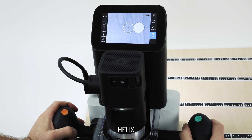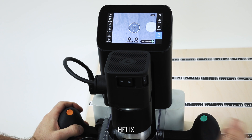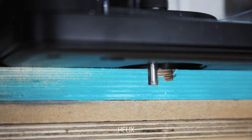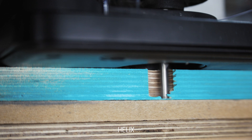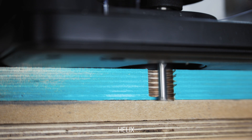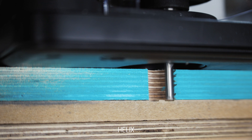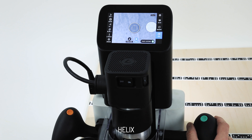Hole drilling is a common undertaking with Origin and we've made it much more productive now. It's a helix path, which means we spiral down into the material slowly, keeping the bit constantly loaded, and cleanly and efficiently removing material all with one click. Rather than, say, for a three-quarter-deep panel having to do three passes and a finishing pass, we can do it all with one click now. It's as effortless as hitting the helix button.